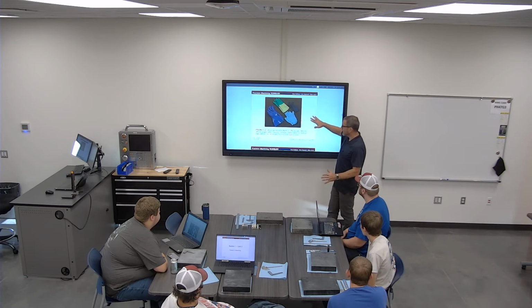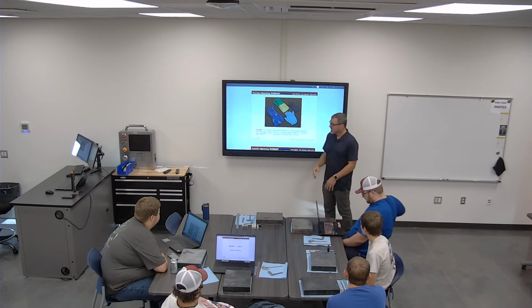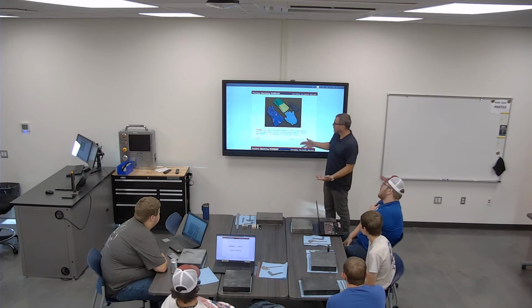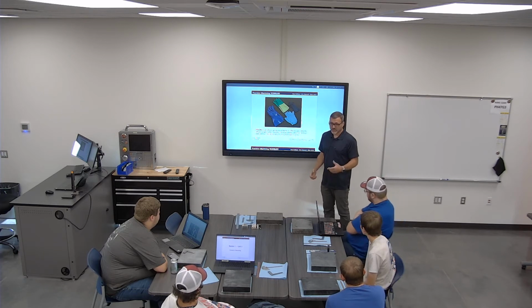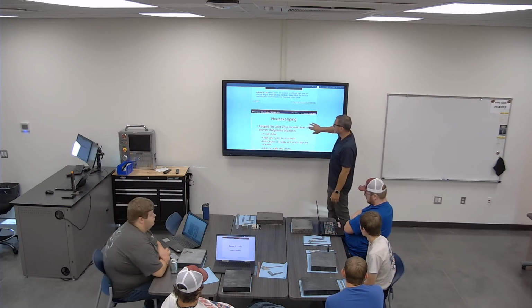Gloves are great. When you do NC3, gloves are appropriate for measurement. Gloves are appropriate for handling chemicals. Work gloves are appropriate for handling things like bandsaw blades. What you don't want to do is use gloves on the drill press or the vertical bandsaw. It's too easy for those things to get snagged and pull you in. Honestly, it's better to lose a finger than a hand, though both of those suck. That's why we're using push blocks. We don't want those things to happen.